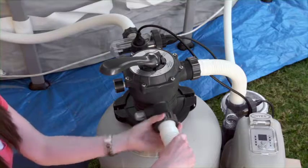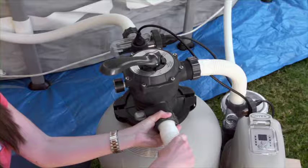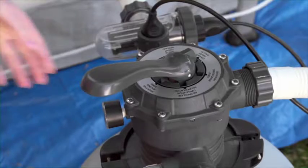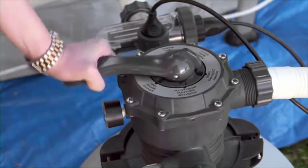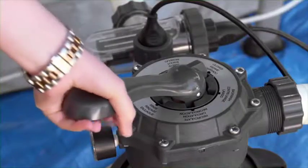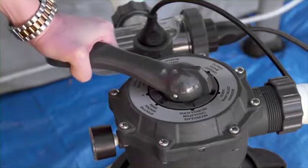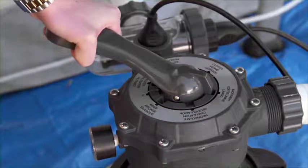You may use the hose between the outlet port on the 6-way valve and the upper plunger valve on the left after closing that plunger valve. Once you have connected the hose, depress the 6-way valve handle and turn it to backwash. You must depress the valve handle first in order to turn it. Backwashing is the first step in flushing dirt and air out of your system.